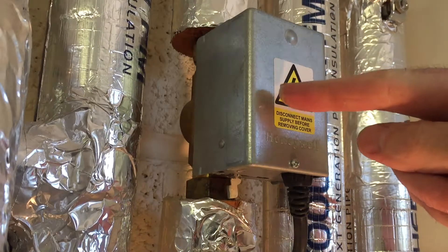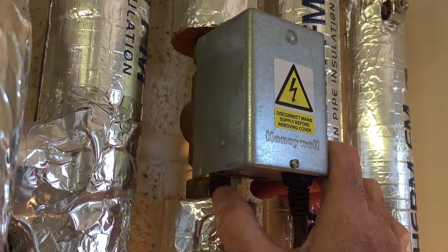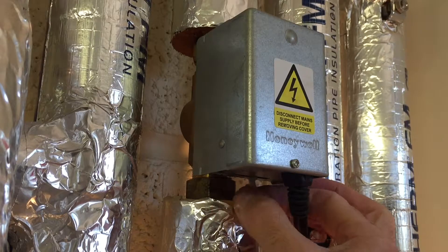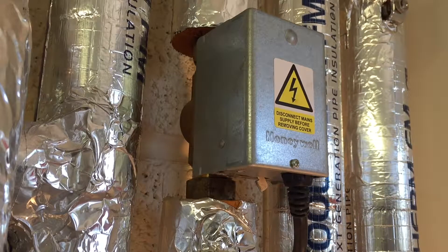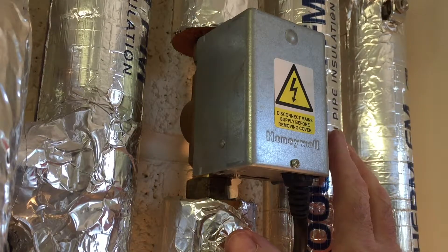The valve is opening, and when the valve is open it sends an electrical signal to the boiler to come on. This lever below here — when the valve is open it's free to move backward and forward. If I leave it to the right in the open position, the motor is allowing the valve to let water through into the system. I'm going to turn the heating off now — watch what happens to the lever: it closes the valve. If I turn the heating on, that valve will open, and the lever is free.